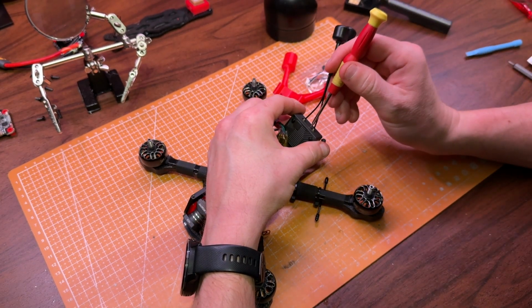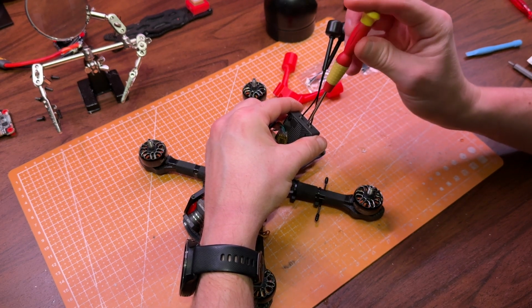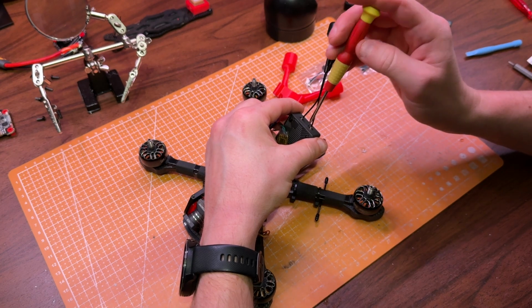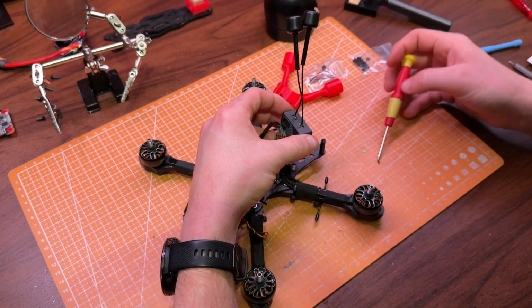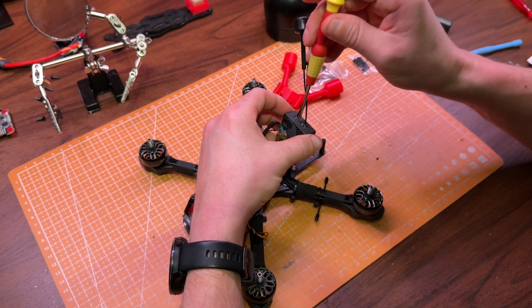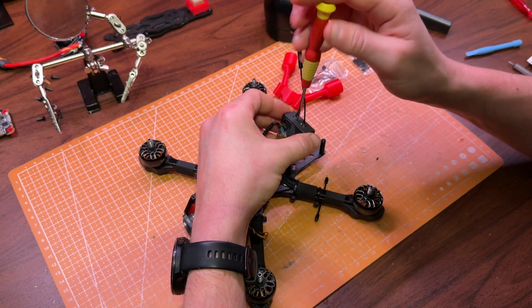To get the antennas into the TPU mount, I need to disconnect them from the VTX unit. They're a bit tricky to reach. First, you have to remove the 2 screws holding the small cable guard in place. That's what keeps the antenna wires from popping off. Once that's off, you'll need a small flathead screwdriver or a pair of tweezers to gently release the UFL connectors.